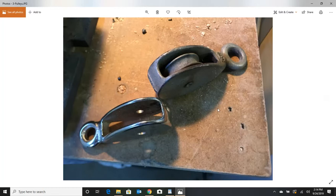Go to your local hardware store and find some rope pulleys. Bring your tape measure and make sure they measure across an inch and a half. I've got links to buy this stuff if you can't find it locally — just go to the information section of this video. You're going to have to bring the pulley to your bench grinder, grind off the rivet, and get it out of there. Then take a 15/32 bit and drill it out so it fits over the shaft. That's the measurement for a Ridgid — if yours is different, just measure and drill a hair bigger so it slips right over. You're not worried about threading it on.